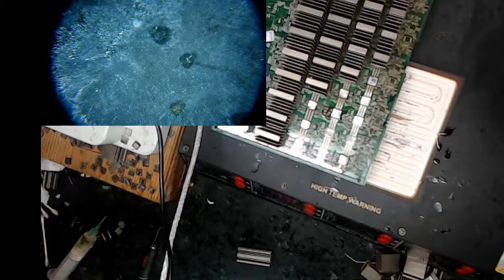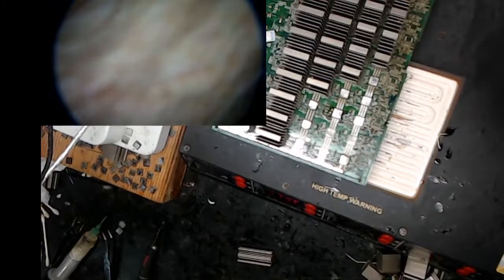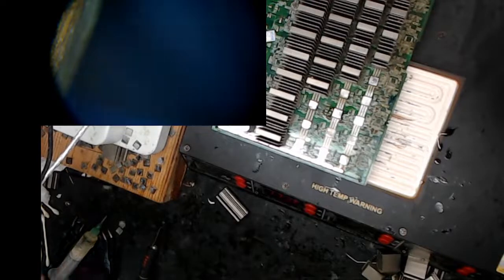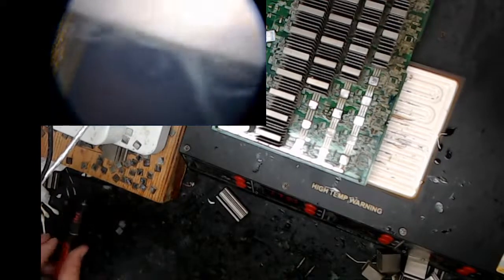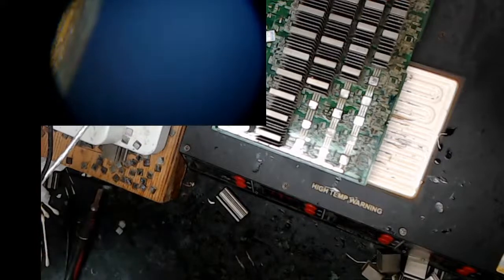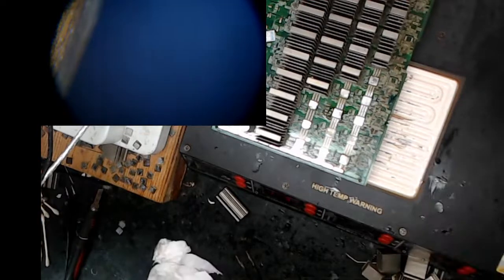Just a minute or two and we'll run it again. I want that to get nice and warm. I'm going to go look at it, make sure it's... Yeah, so it's really centered nicely. Hopefully with not a large amount of flux. I think we can go ahead and put this guy on. So I get my tweezers and my flux ready. And hopefully my flux needle won't... Well, actually I want to clean that up because that's just going to be a big mess.